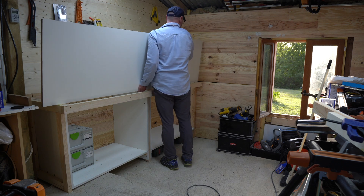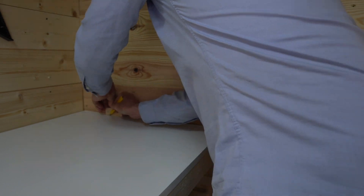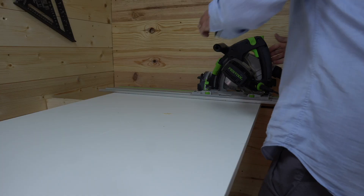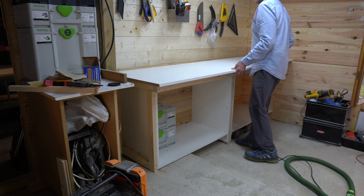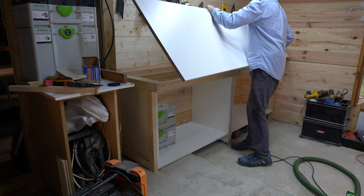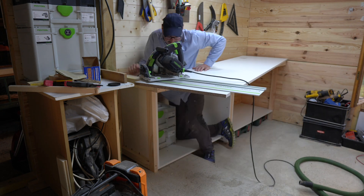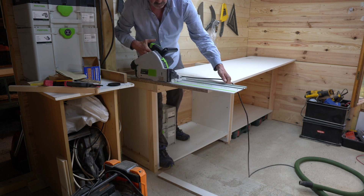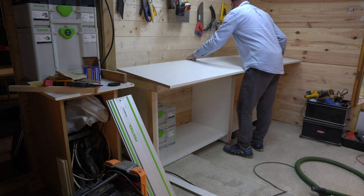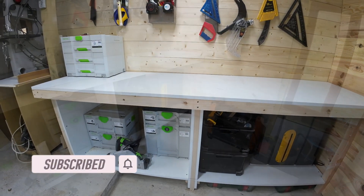Now here is the controversy of this workbench: I'm using the same 18mm melamine-faced chipboard for the top — at least for now. I'm exploring a few different types of tops, but I just want to get something usable on there and come back to it when more elements of the workshop are established. For the price — 18 euros — it should last a good few months of cutting and hammering, and chipboard is relatively stable in humid conditions. It will be an interesting experiment to add to my previous plywood and MDF experiment. Like the shelf below, the top needed to be scribed into the right-hand end. And there it is — the structure of my new bench with built-in tool storage. I'll see you next week when I'll be doing some more work on this bench.